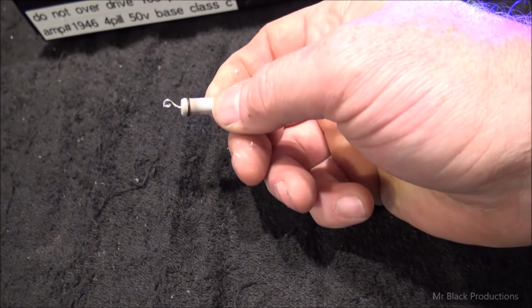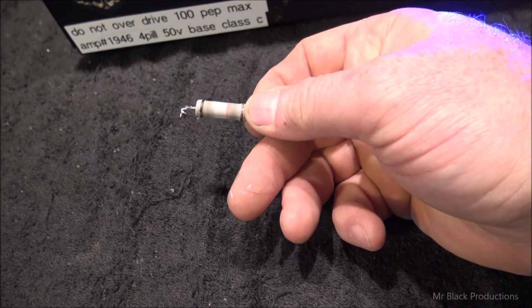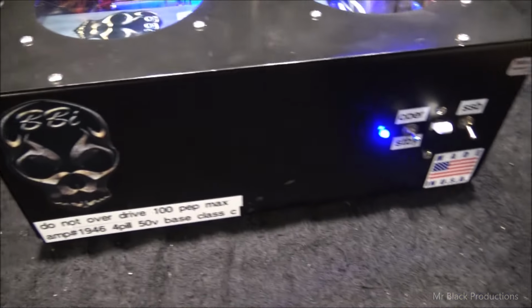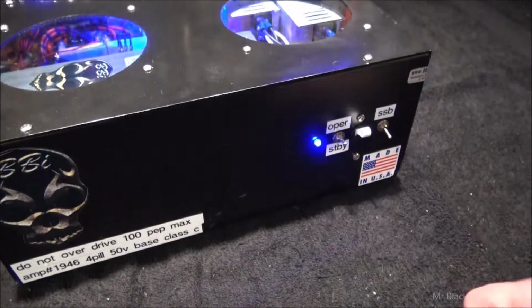And of course, the combining balance resistor, which sucks up the difference between amplifier A and amplifier B, was smoked. So, Chad, we put two new transistors in the box. And then I got this going, thinking, okay, I'm just going to pump it right back out the door to him. Well, he calls me and says, man, I want you to add sideband to it.